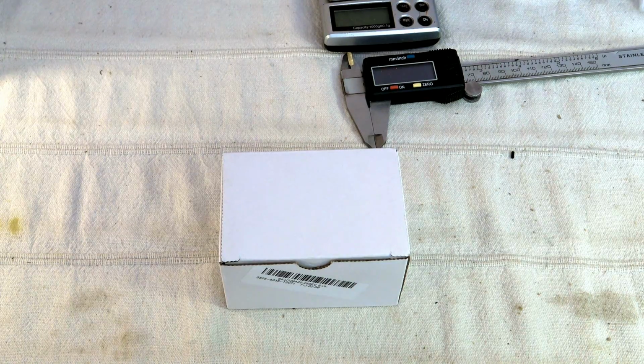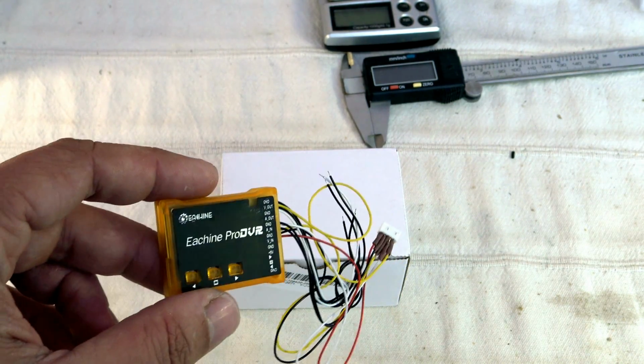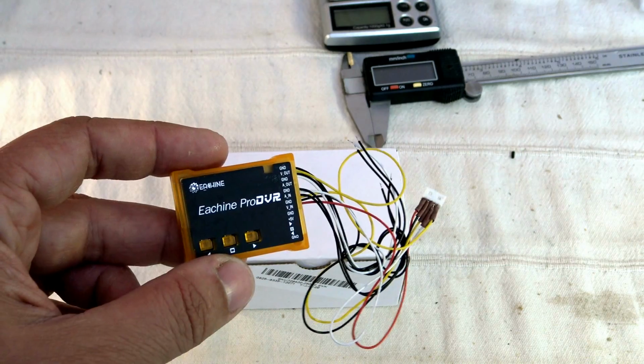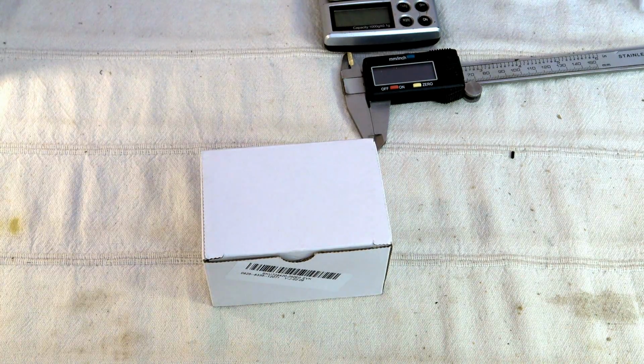And I will say the third point I will try to focus on is about the cropping. The Pro DVR first of all needed some firmware to be PAL compatible, and I would say not all the Pro DVR modules were able to apply this firmware because there were different versions of the PCB. We will see if this one is simultaneously both PAL and NTSC friendly. What I mean is, for both TV systems, there is absolutely no cropping in the recording.